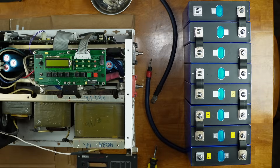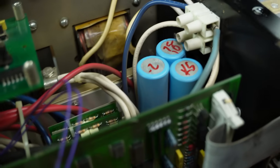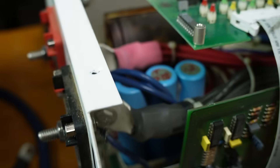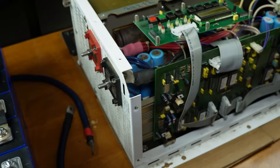Capacitors play probably a few roles in the way an inverter works. One thing they can do is give up their energy really quick. And on the other side of that coin, they can also receive the current flow coming out of the batteries almost instantaneously. So if you go from empty to 100% full on a capacitor, you're probably going to run the risk of damaging it — and that's where the problem lies with the inverter.